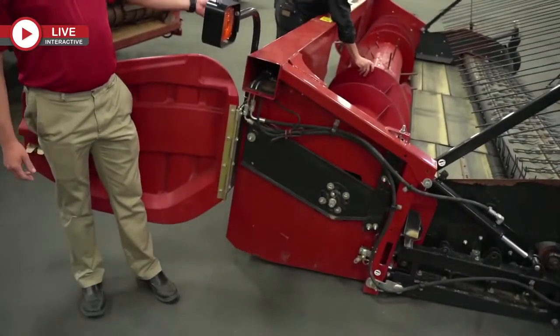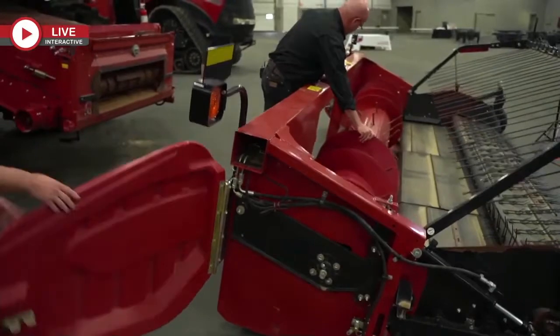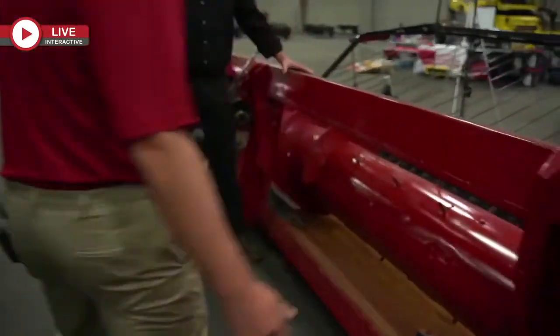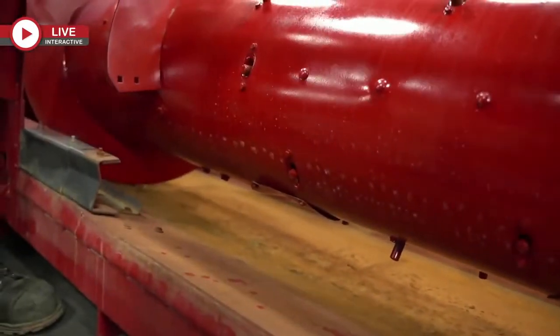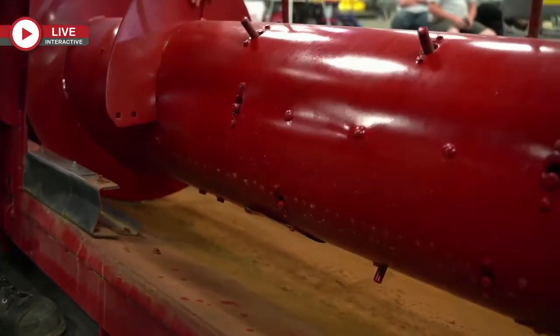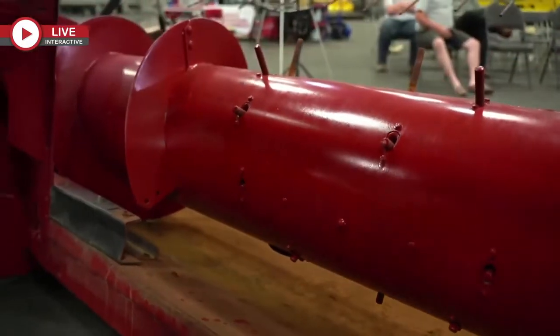When the fingers are in the 8 o'clock position — when we walk around the back side of the head — you can see we have this finger in the 8 o'clock position. We want that flush with the edge of the auger. This one's pretty close; it's not perfect, but it's damn close. Just something to watch out for with your pickup head.